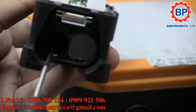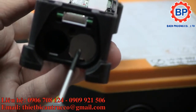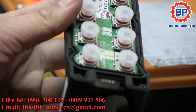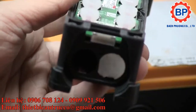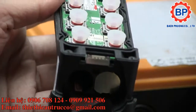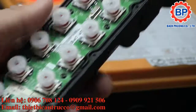And then on the inside here, one of the batteries actually blocked out here. It only needs 2 AAs, but at some point they had models or software or hardware that required 4 AAs, because the internal compartments are designed for 4. Now you only need 2, so maybe they did a hardware iteration where they switched from 5 volts to 3.3 and they're saving that much more power, but you know what? Good on them for that.